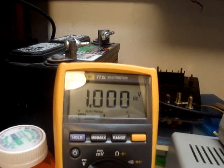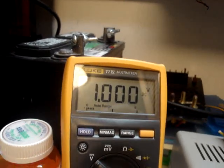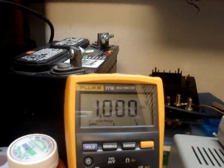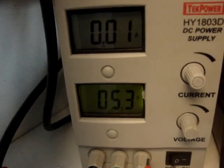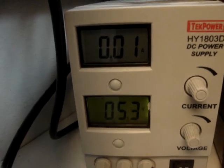That's the power supply that feeds the power FET that feeds the coil, and that's to three decimal places. Now there's a 5.3 volt supply that feeds the Hall effect, but this does not in any way feed into the power going into the coil.